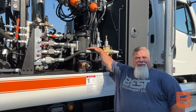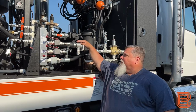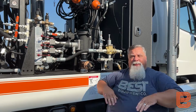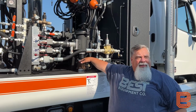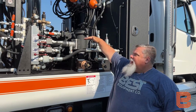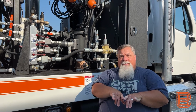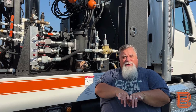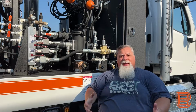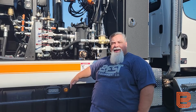have water trapped inside of the water pump. So when we hook this hose up to air purge, we're blowing water off the exhaust side of the water pump assembly. The lower section, we've drained the lower side of the water pump with our drain at the beginning of this series. We have air purging across the top, but we have water trapped in each one of our cylinders. So one of the last steps we do is we need to start the water pump assembly, allow those cylinders to rotate, push that water up into the exhaust section so we can push that back to our tanks.